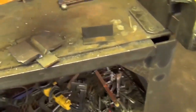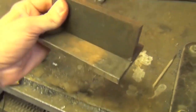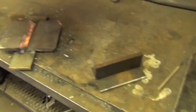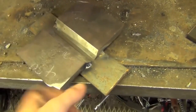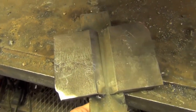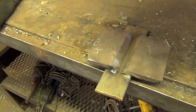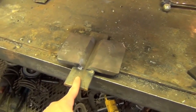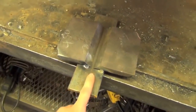I have some 3/8 plate that I tacked up into a two-sided fillet weld type deal. I also tacked up an open root with a backing strip type bevel joint. I know we're obviously not going to have enough electrodes to fill this, but we're going to fill that pretty fast. Since I already had the material cut out, we'd use up whatever's left on this. We are going to be running this on both DC electrode positive and electrode negative.